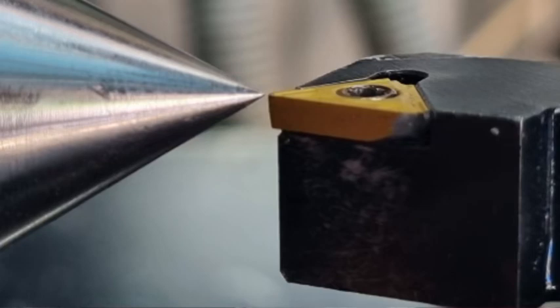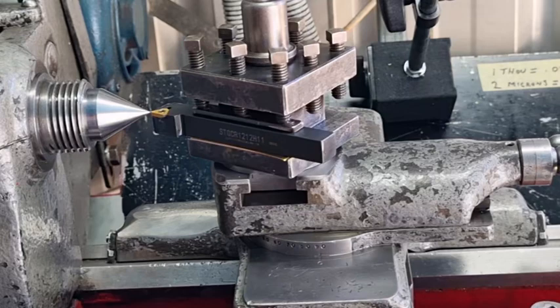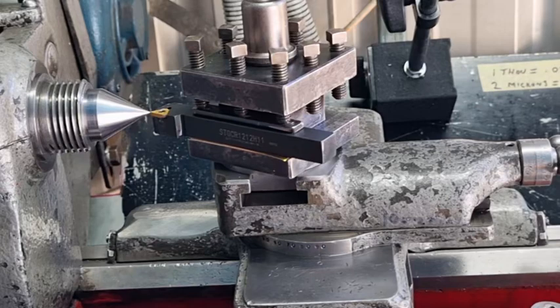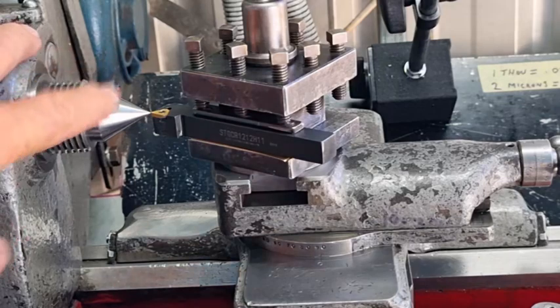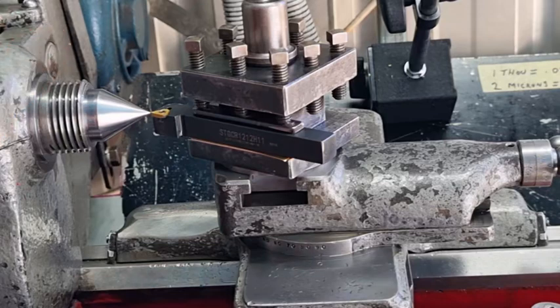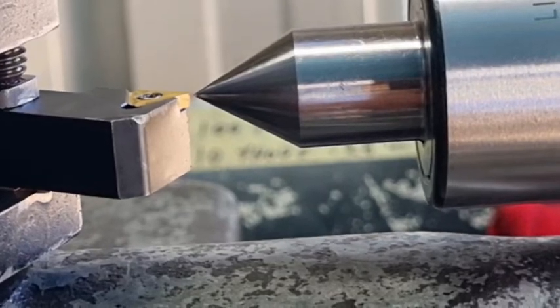Clearly you can see from the picture that it's lined up within a couple of thou. A lot of times I like to keep the tool post slightly higher — just a thou — in case there's a little bit of flex in the tool. But give or take a couple of thou, it's not going to be the end of the world. Get it as close as you can. That's the method on the headstock. Now we'll go to the opposite end — I've got a live center. I aligned my tailstock a while ago and it was spot on, but if you're going by height, this is the most accurate and most important reference.